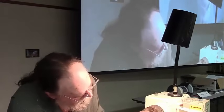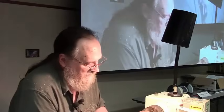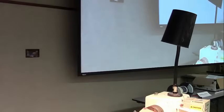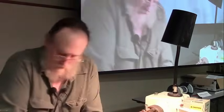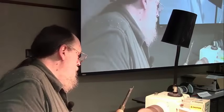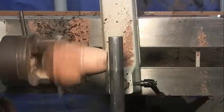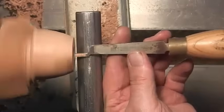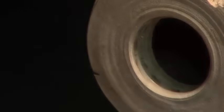It's a hair tight, which is the way I like it. That permits me to monkey with it at this end. Remember — you can take it off but you can't put it back on. So here's how I actually learned to chase threads: across the bar here. The reason I'm doing it now is it allows me to be a little tougher on the material. When I chased it the first time it felt very rough, like it was chipping. So I'm using an alternative method here to make it smoother.